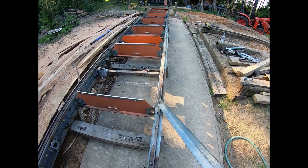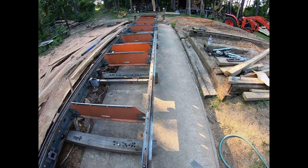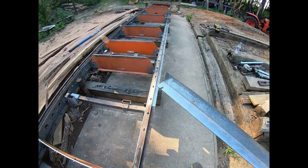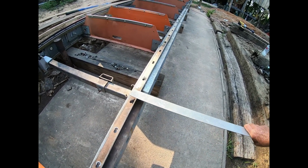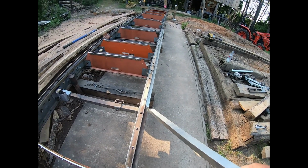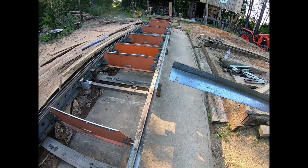These rails, if you've ever dealt with dozers, changing out the tracks, it's metal on metal. It's going to wear down. What I do, I'm not 100% certain this is a good idea, but it's what I do. I go along with this device. This is their tool. If I get to a spot where there's just no play, like right there, there is none. But if I go right here, see, there's a bunch. That's because this is mushroomed down. Metal on metal. It's a little fatter. I'll go along with this and check the whole route.